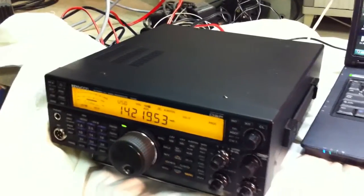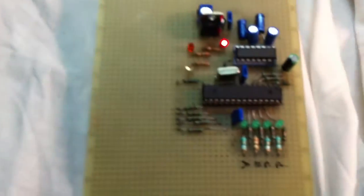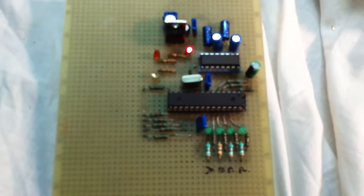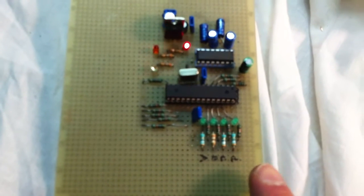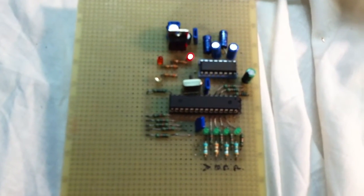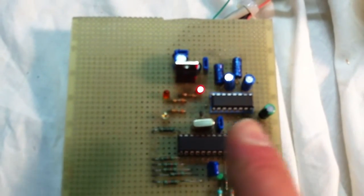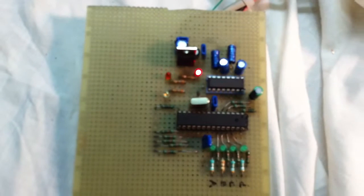Now this radio is connected to the computer via RS-232. So I thought, let's make an RS-232 sniffer with special software which will provide me the same BCD code output like, for example, Yaesu is giving standard on the back — for an FT-1000 it gives the ABCD for the band data information. We are using an Atmel small PIC, and this program was not programmed by me but by my friend Marcel Haas.